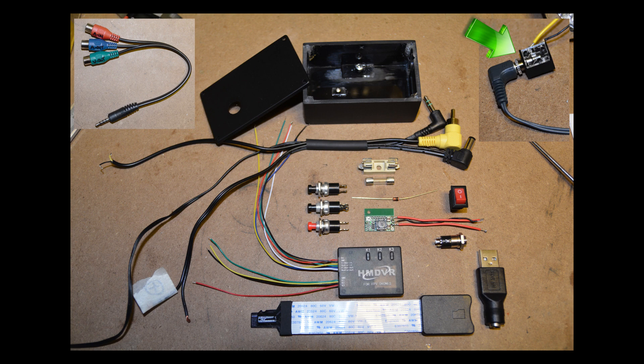A 4-pin 3.5 millimeter jack socket. Another 3.5 millimeter jack socket — as long as it has two pins you're good — this one goes into my previous build, the IR scope. A 5.5 by 2.1 millimeter male DC plug cable, preferably with a 90-degree bend. Same goes for the male RCA plug and the 3.5 jack plug. Optionally, a 5.5 by 2.1 millimeter to USB adapter, which comes in handy if you want to run the DVR from a phone charger.